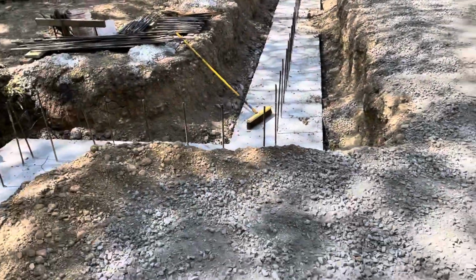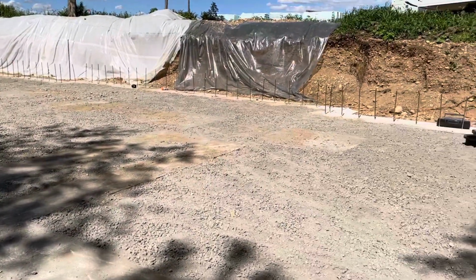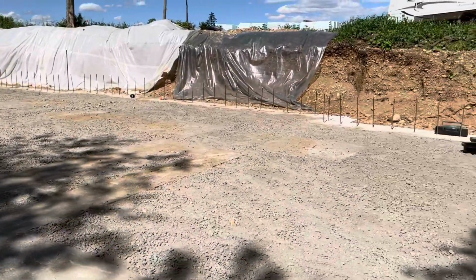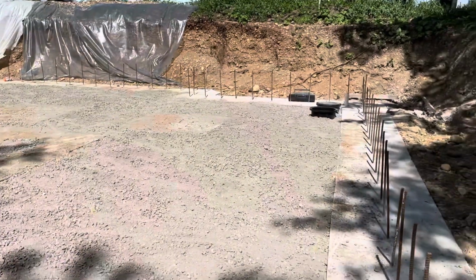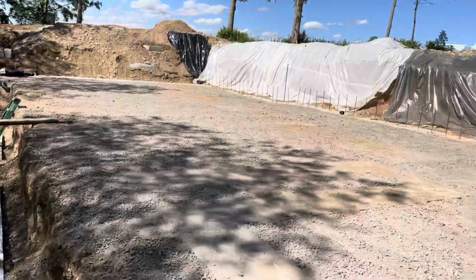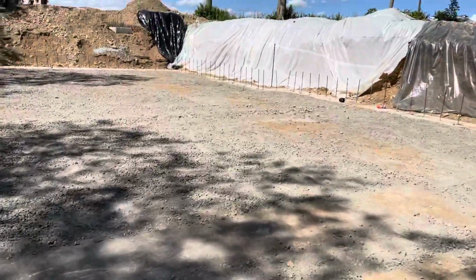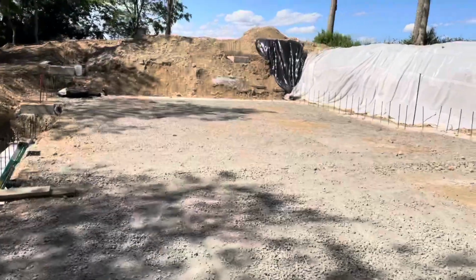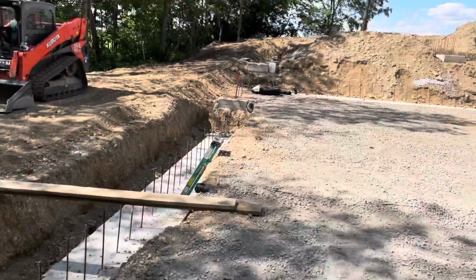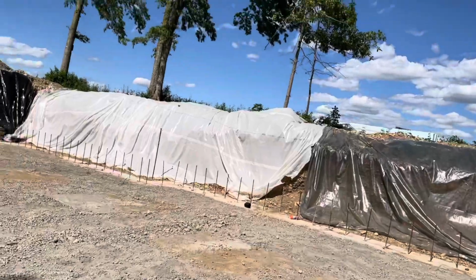So yeah, pretty exciting. Another day, very hard work, and at least it wasn't so hot. High of 72 or something. Very nice day out. So yes, sump pit's in, the sewage pit's in, the tiles are all in except for 10 feet up there, and the gravel's level. So tomorrow on our next video we will square it up, and we use our batter boards, put our strings back up, get the house 100% square, get all the lines chalked. We should be starting building walls by noon tomorrow, hopefully.